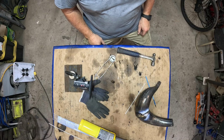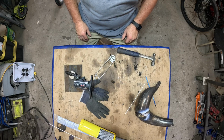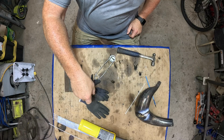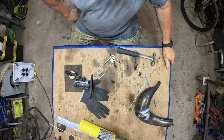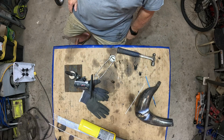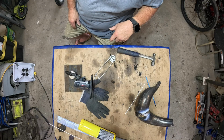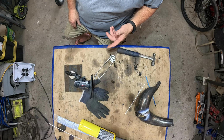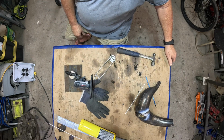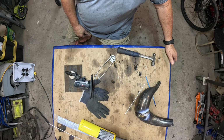We're gonna be doing some more of this, and like I said, I'm gonna get out there on the, this thing heated up, didn't it? On the Dominator 85, which is running absolutely beautiful. I fattened it up on the bridge run up and down really fat because I wanted a lot of oil and gas going in there. Because it's a new motor, new rings and everything, just had to put it to the test, and it did well.